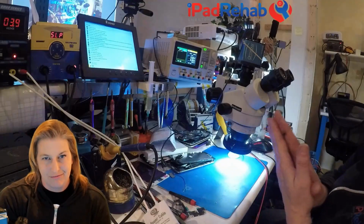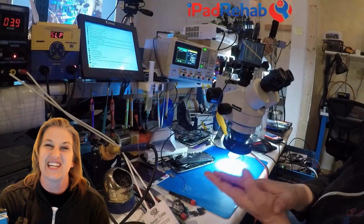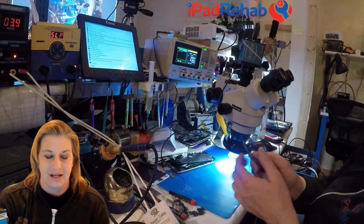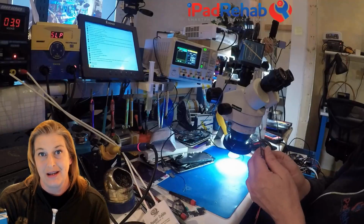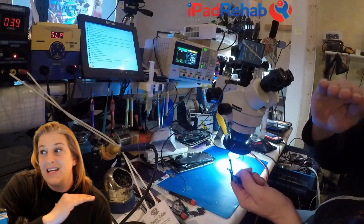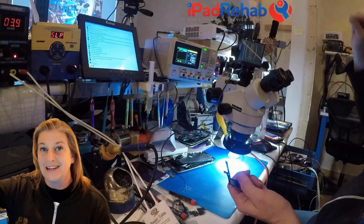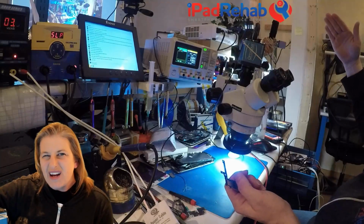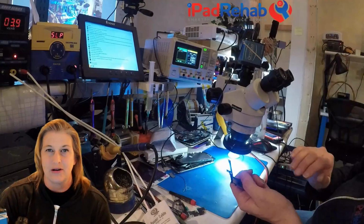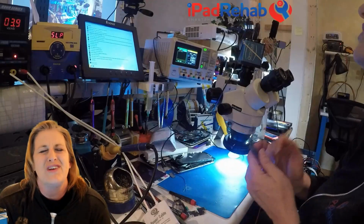And I think it's important to point out here that not every problem is a short. In fact, I titled this video like, is there a short? If there's heat, hot enough to make you go, oh, that's hot, heat is a short. If it's warm, that's not necessarily a short. If it is behaving in a DC power supply, if it does not have any kind of high current consumption, and this one does, it goes 30, 30, 30, 100, 30, 30, 100, 30, 30, 100. That time above 1 amp, that's a short. It's a short that's transient. It comes and goes, but that is a short. If this phone was just super low on DC power supply, then it wouldn't be a short. So not every problem is a short.